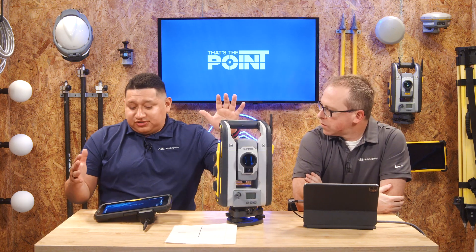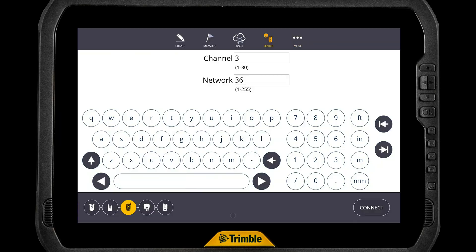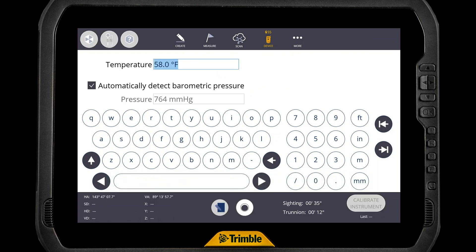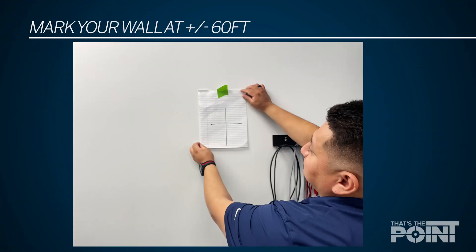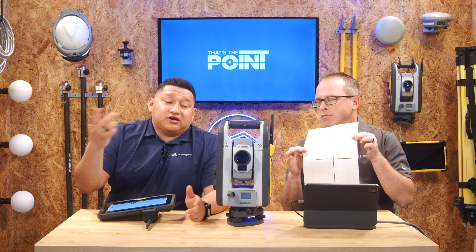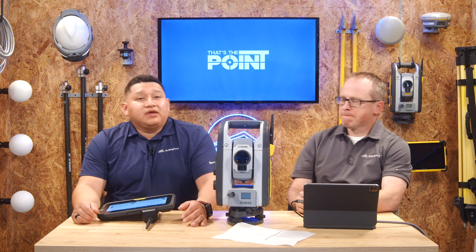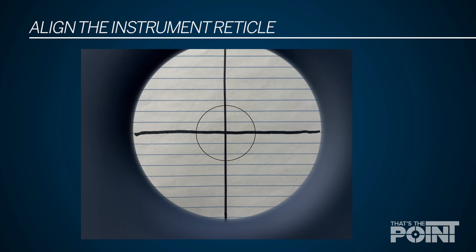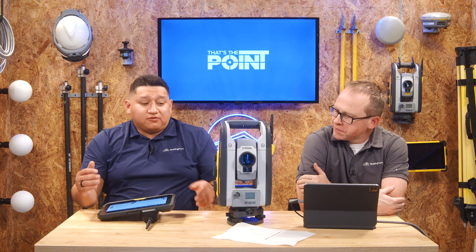Make sure your tablet's on, equipment's on, and it's level within spec. Open up your Field Link application and connect to the instrument. Make sure you have a mark within 60 feet or so. If you can't make a mark with a Sharpie on a non-reflective surface, go ahead and use a piece of paper, draw an X on it, and tape it up on the surface you're going to shoot to. From there, use your coarse sights to aim the instrument directly towards that target — right on the crosshair. Use your servo knobs and line it up perfectly as best as you can, looking for that reticle to line up to the target.